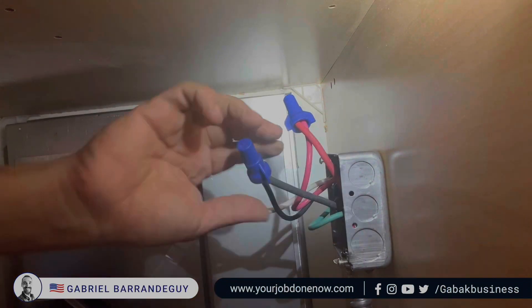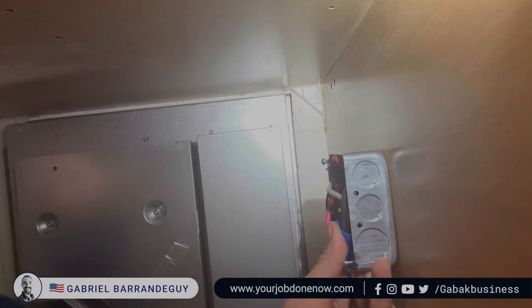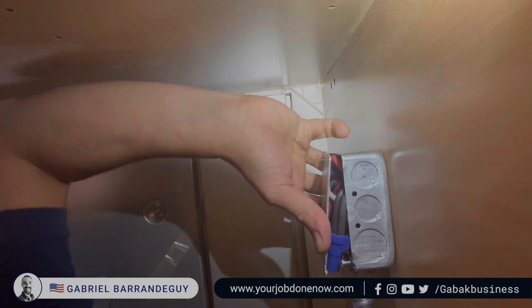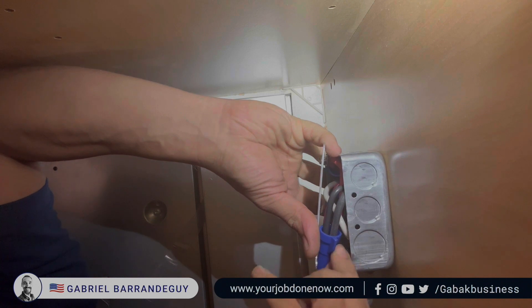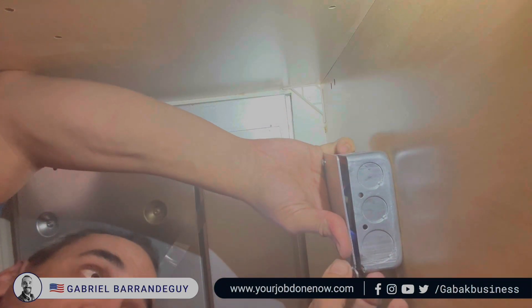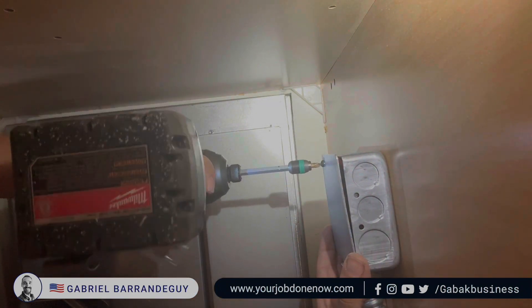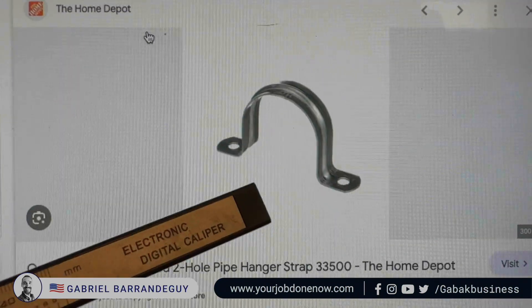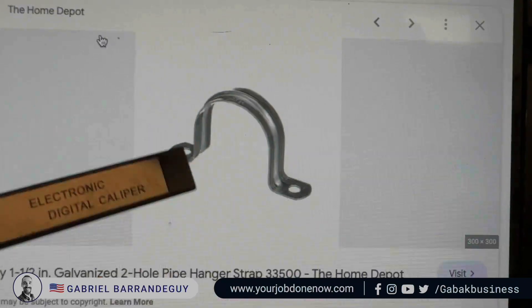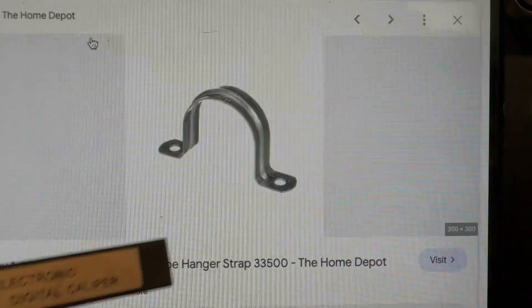After that, push everything inside the electrical box and you should be good. Make sure everything is tight and firm — otherwise if the wires are not tight enough you're going to have issues; this can catch on fire very easily, and you have a lot of current consumption here. I'm removing the screw so it's easier to put back, then use the screwdriver or impact driver. All the screws are back, the connector is over that area and everything should be good. If you buy pipe clamps you can secure the slack of the wire in place so it's not hanging everywhere.